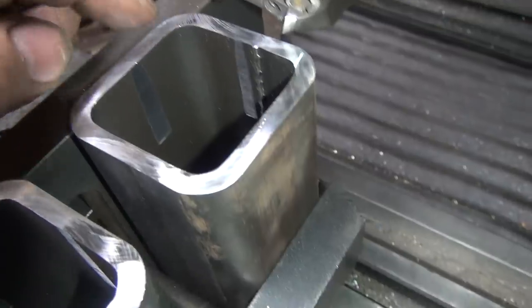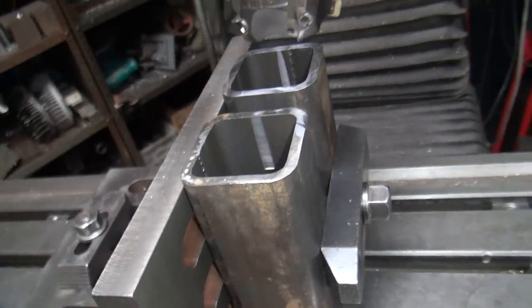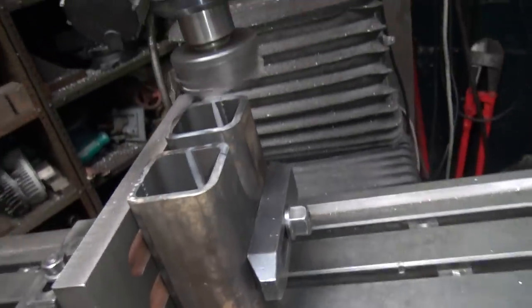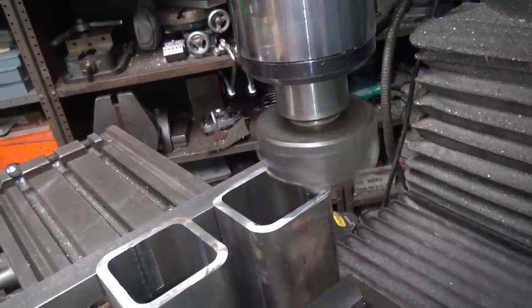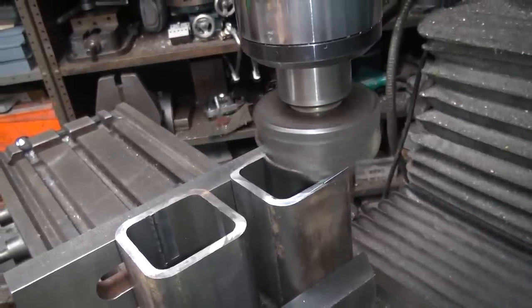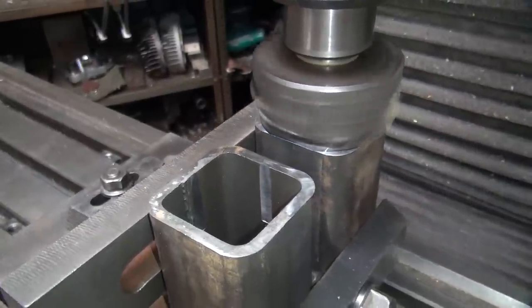Never put your fingers near the cutter. You can see how it's all cleaned all the way around there, but it's not cutting right here — it's only cutting from here to here. All this other stuff is low. So when we put these things in there before, it was only hitting on this corner. I'm going to cut this again — there's another five thou. You can probably push seven without too much problem. We got it cleaning on that back corner — yep, that's all 100% cleaned on that side.